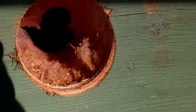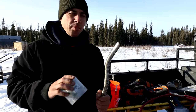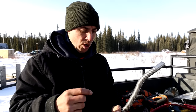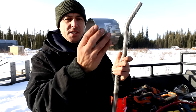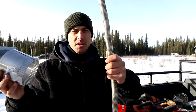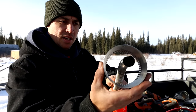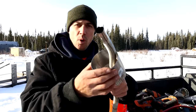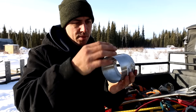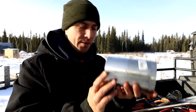Now the fun stuff. We're going to try to build what I believe is called a thimble — like where you'd put a wood stove pipe through a wall. This is going to go through the wall. We're going to make this a 3-inch because it's 4-inch right now. Here's the diesel heater exhaust — we're going to float it kind of in between this pipe and the wall to keep things from getting too hot. I'm going to slice these and roll them in, and we've got two of them. We'll stick it in the wall and see how it looks.